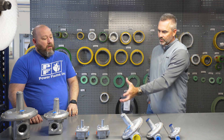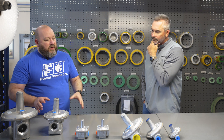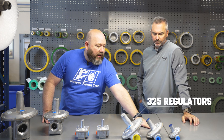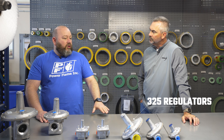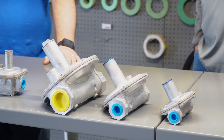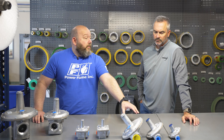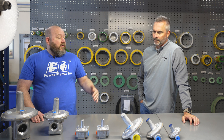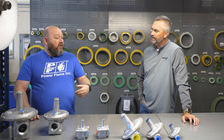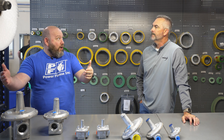We've got a series of 325 regulators, which you'll see on a lot of appliances and residential type equipment. When we get into bigger boilers, you'll start to see a lot of those on pilot lines. The 325 series is what controls the light-off for the bigger burner.